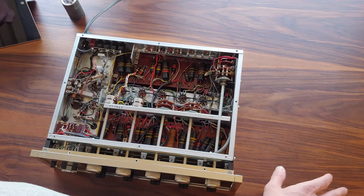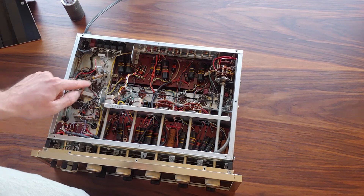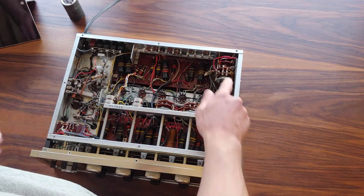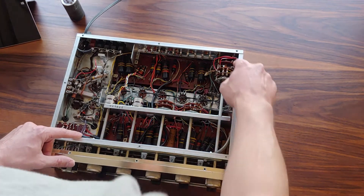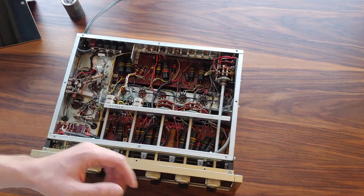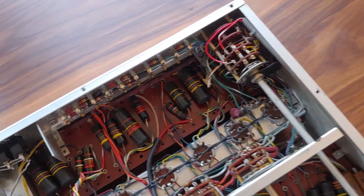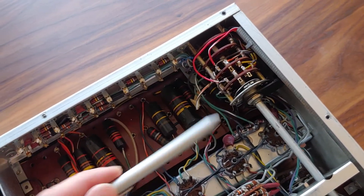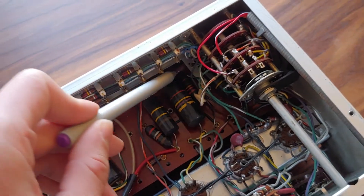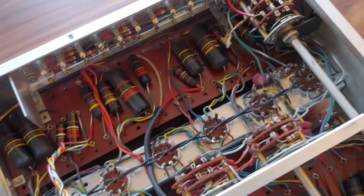The amplifiers that run with this are on their own relay system, so there's no problems there. We're going to replace this capacitor, and probably these two capacitors as well. These weird lengths of wire that were just added in — I got rid of most of them. These red ones had them and there was enough length on the other side that I was able to just stretch those over. This green one down here runs back behind that capacitor, so I'm going to replace that entirely with the same stuff — the 22 gauge solid.